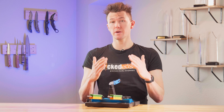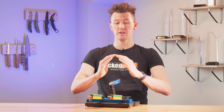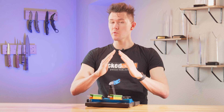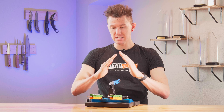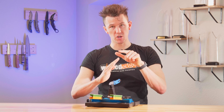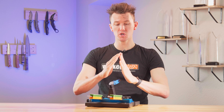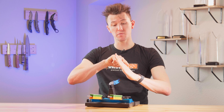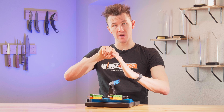This is important because with a knife, if it is a little bit dulled out, its edge may look like this rather than like this, and we don't have good enough eyesight to actually see that our bevel is reaching all the way to that edge. So when we push over that little curl of metal at the very edge, it confirms that our bevel reaches all the way up to the very edge of the blade.